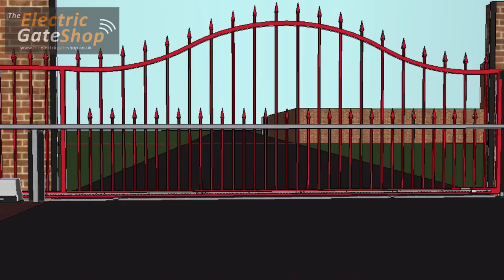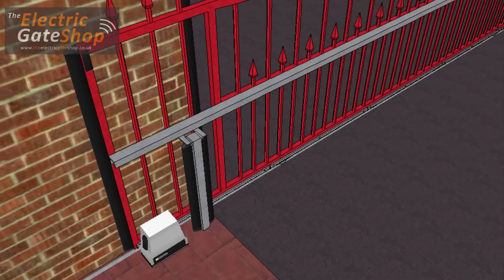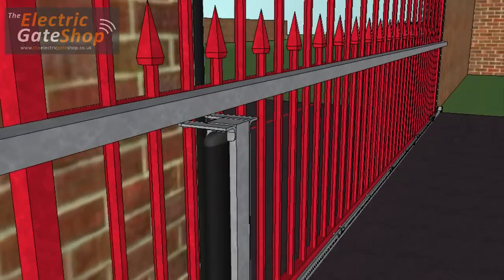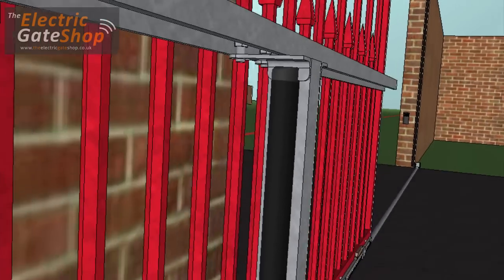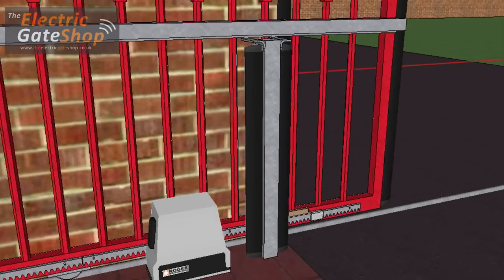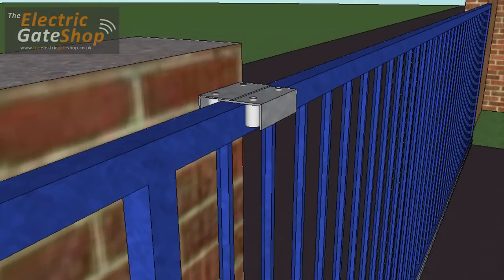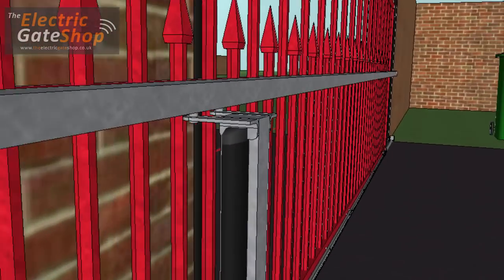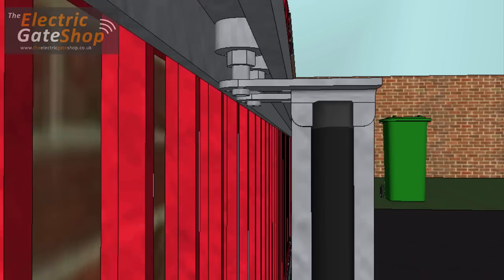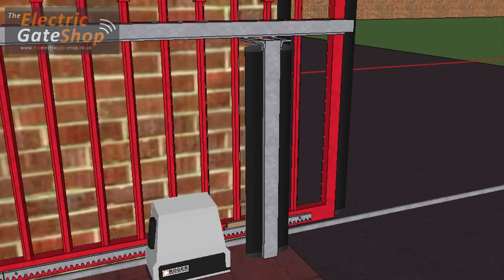The recommended practice to support sliding gates is using a C-channel, roller and support post. The C-channel is fitted mid-height on the inside of the gate and runs along a pair of rollers attached to a support post. The support post has safety edges attached to either side. The C-channel support is ideal for gates that don't have a flat top. If the gate does have a flat top, then roller sets are available to support the gate from above. Although for safety, we would still recommend the C-channel and post to ensure if the roller fails, the gate won't fall onto a pedestrian, only onto the support post.